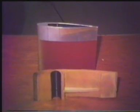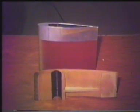Now this is just a demonstration which I showed you just now of how flexible the straps are, and that's laminated stainless steel. There's two of those on each blade? That's correct, yeah. And that's the Armstrong blade there. The Armstrong blade is at the top, and the hollow balsa blade is the one at the bottom. It's sort of sliced in two. So it's a steel tube, a solid spruce leading edge, and a half-inch diameter steel rod is the counterbalance. You have to balance at the quarter chord. And the trailing edge is a series of balsa ribs and balsa skin. All that's covered with fiberglass. And we did all our flying with those blades quite successfully.